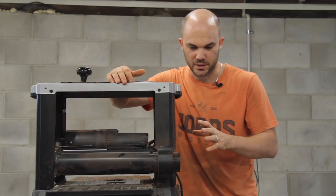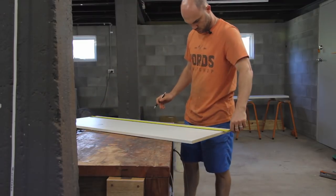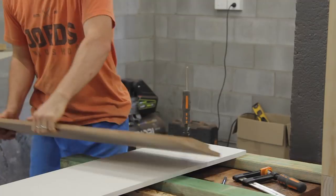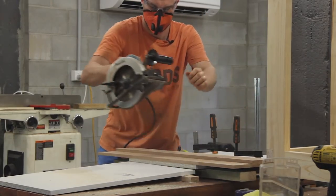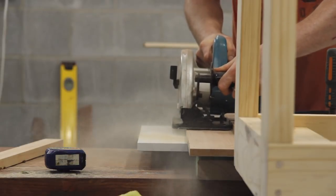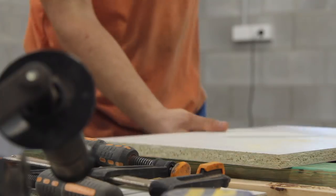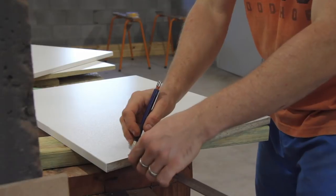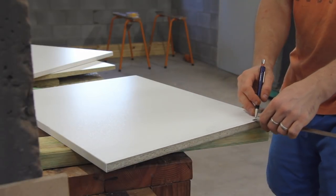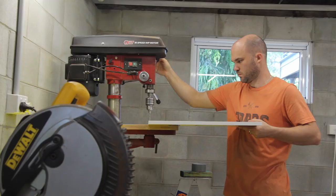So what I want to do is create some kind of box that'll sit underneath the thicknesser with a hose connected to this ejection port, and then all the dust and chips will be pushed through that hose into that box, and that becomes my dust collection point. In the future, I might hook up a shop vac to that box, so then the box will sort of work as a first stage. But for the meantime, that's going to be my main dust collection point, and it's working courtesy of the fact that this thicknesser kicks out the dust and chips with such a force.